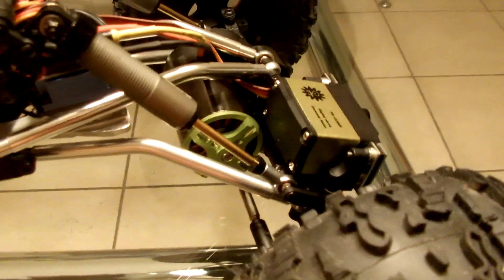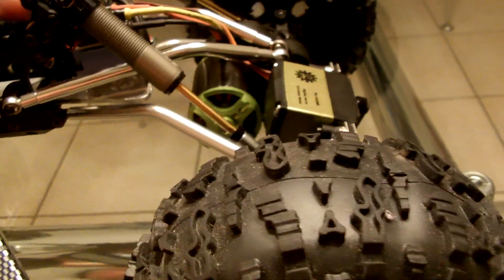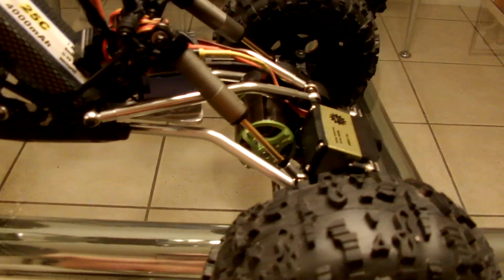I've got one ESC for each motor. They do quite well. I don't have them both hooked up - I'm just gonna show you what they can do by hooking up the front one. I just didn't have a chance to hook the whole thing up and program the controller. But just so you guys can see that there is actually control of the speed on these motors - that's the major concern a lot of people have with outrunner motors, especially sensorless like these. They feel it's not gonna have any kind of low-speed control, that it's just gonna be jerking. Well, in actuality, when you get a good ESC, that is no longer a problem.